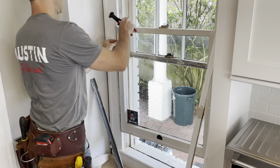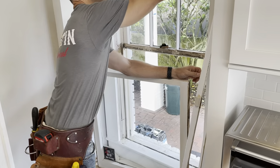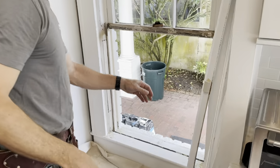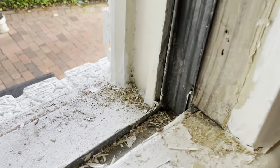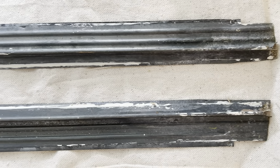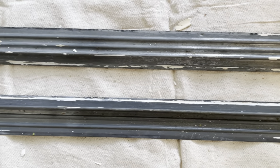In this case, I'm cutting the ropes out because we're going to be re-roping this window. You can see the weatherstripping remaining here and down at the bottom — how it overlaps one fin onto the next. You kind of lift it up and off of there, and then it'll come off quite easily. These are the bottom sash weatherstrips. They've been cut very specifically, so make sure you remember that these go for your bottom sash.